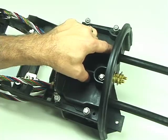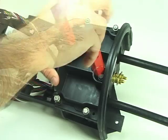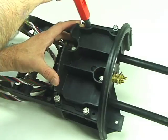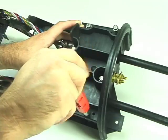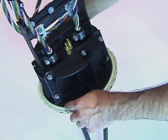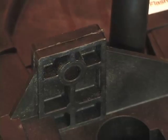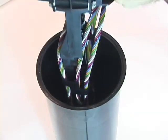Replace the C-half sections. Begin tightening the bolts using a criss-cross method, a few turns at a time, until the C-half section is properly seated. Torque the bolts to proper specification. After both C-half sections have been installed, place the O-ring on the base flange with the rounded side facing into the closure. The dome and base feature strand hanger standoffs. These standoffs should be positioned on the same side of the closure for a proper seal.